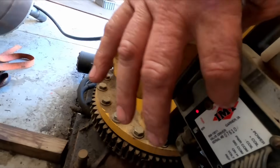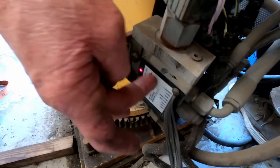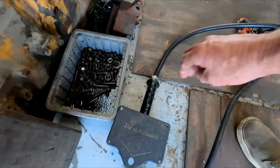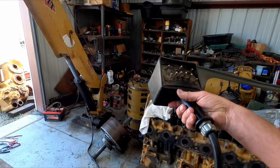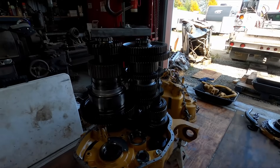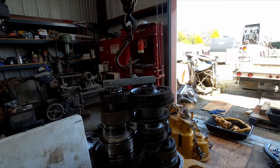Here's the controller for it — see where it melted right there? It was used last week and just, poof, a bunch of smoke came out. I've had five of these cranes over the years on different trucks and every once in a while this stupid controller will just burn out. That's what controls your feathering, so you don't have just full up and full down. Now it's stuck on full out. IMT wants $1,000 for that thing now — we used to buy them for like $200. IMT, your cranes are great, your trucks are great, but that controller sucks and you should just give us replacement ones when they burn out until you can make one that doesn't burn out all the time. Right now I've got to be very careful because I do not want to drop these gears, so I've got to be real careful with my controller so I don't bounce it and break them loose.